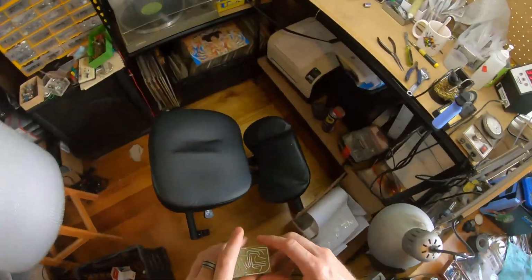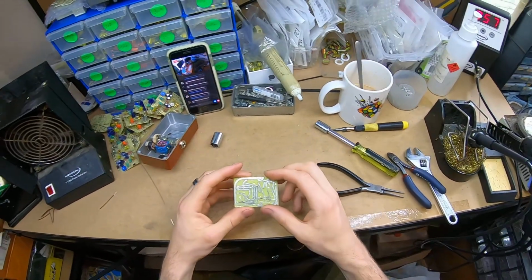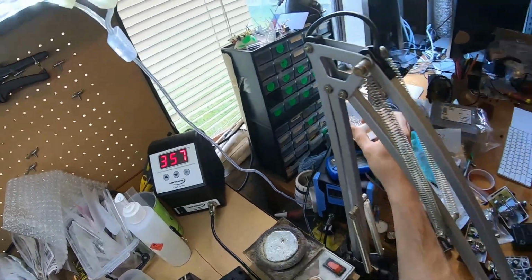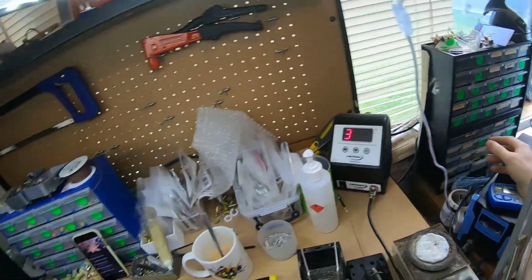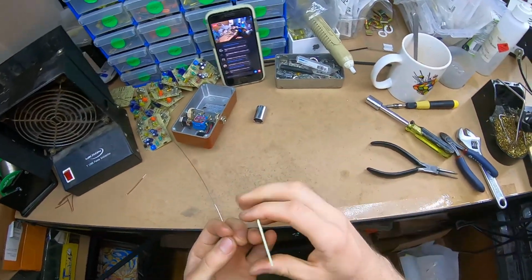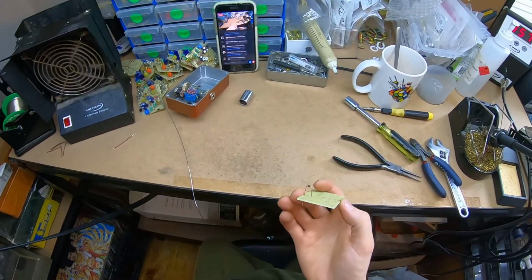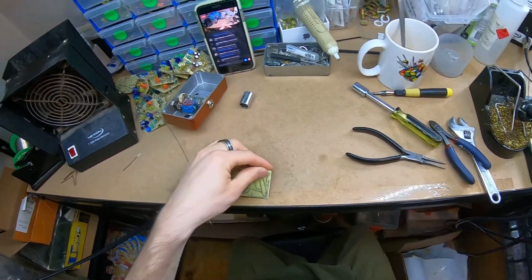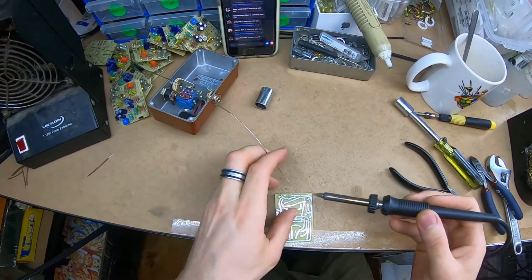Good thing about this board, I don't need a bill of materials because I've just written all the values on the back. Because it's a stock fuzz face, I don't need to hide anything, or there's no room for variability in the future. I decided I want to keep this stock anyway. Well, the original fuzz face didn't have a 6.2 volt Zener diode in it, but this one does. But the parts it has in common are all stock values.